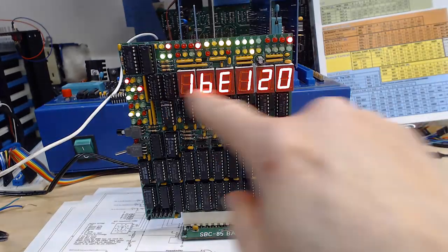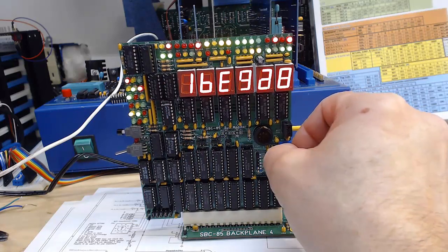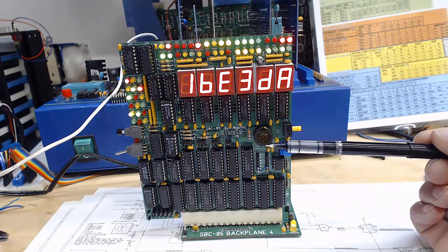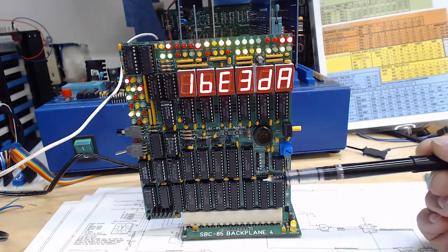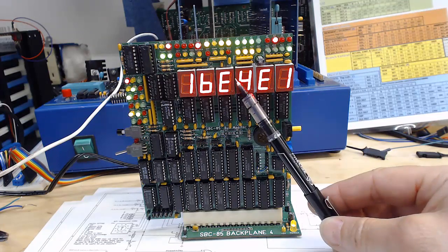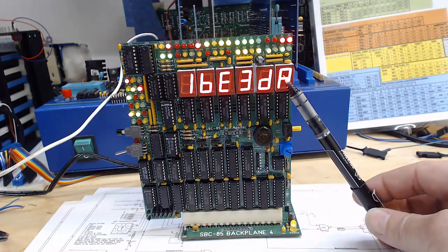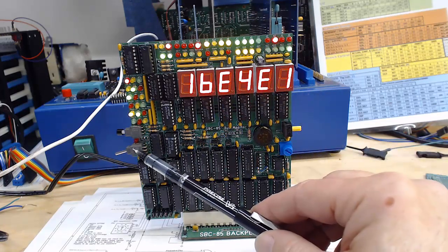The last LED is for interrupt entries. Let's go back to any mode — right now it's going from any machine instruction to any machine instruction, stopping momentarily until the 555 kicks it back into play. We can slow that down if it's easier to see. That's really nice — being able to filter what type of bus cycle to single step on. We also put four registers on this board: a command port and three data ports. The three data ports are for breakpoints — we can put a value in for the most significant byte of the address, the least significant byte, or the data byte.